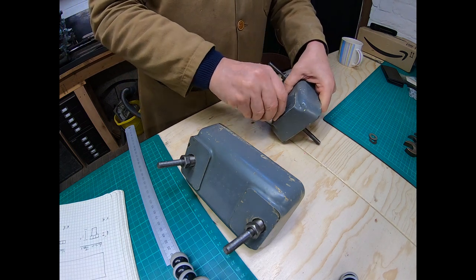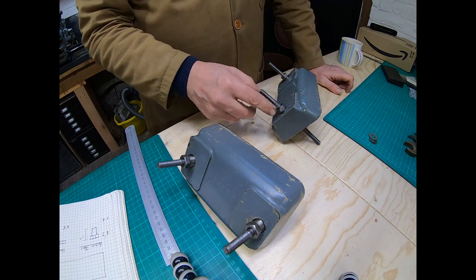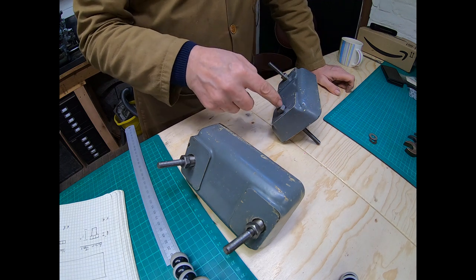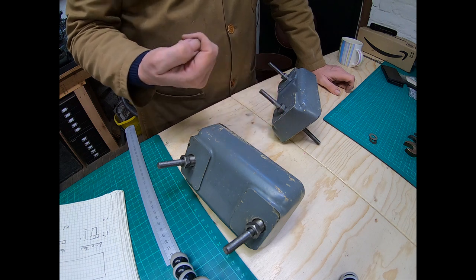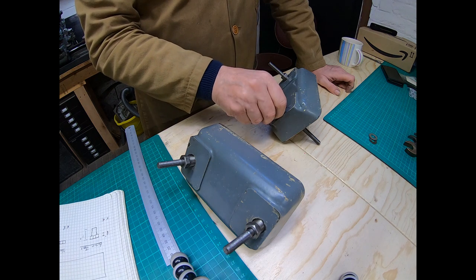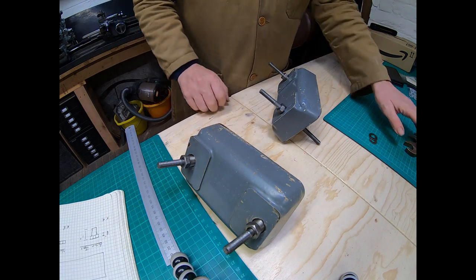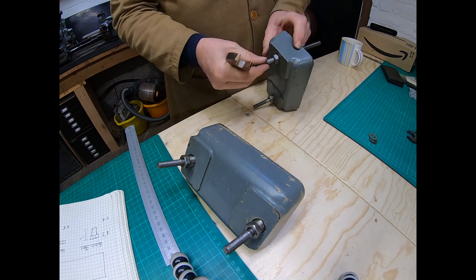I'm quite keen to do that. When I put them on I'm going to put these at the bottom because I'm not a very tall chap and I don't want to get the thing any higher than I need to. Another consideration is the spanner you'll need for these, because once the lathe bed is on here you'll need a spanner that's not thicker than the nut.